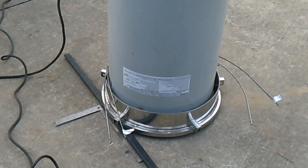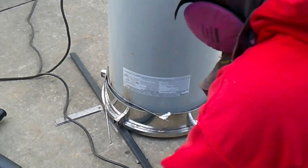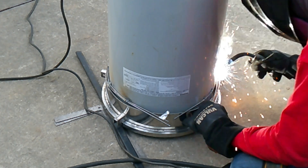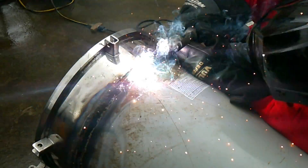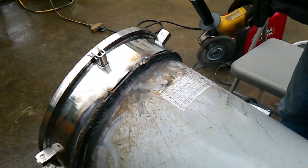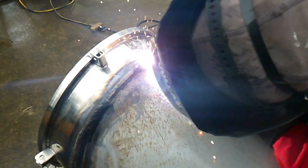When it came to welding the manway on, it was an interesting situation because we had a huge gap — like a massive gap. So I got some small metal rods and bent them around the opening to fill in the gap. It's kind of like using a gigantic filler wire, but I was not going to try to fill a one-inch gap all the way around from scratch. Using those filler rods actually worked really well. The welding process was smooth, I had small gaps to fill, I did six passes all the way around, made sure my heat was good and that I was tying right into the metal — everything melted together nicely and it turned out pretty well.